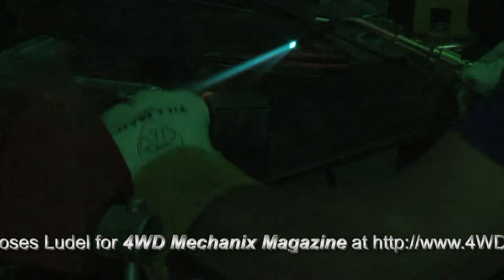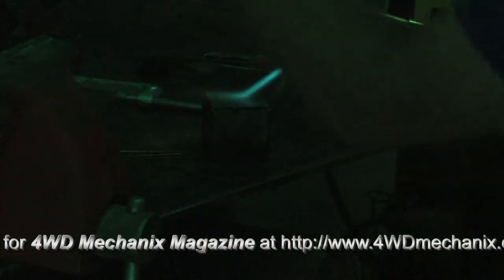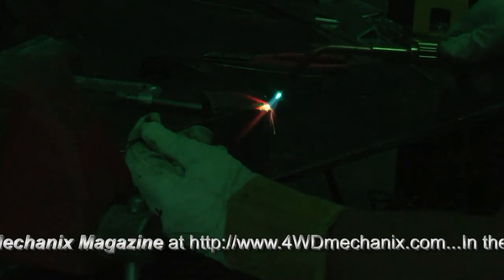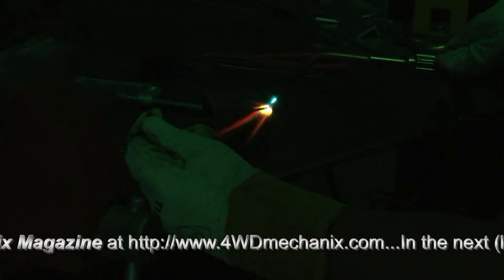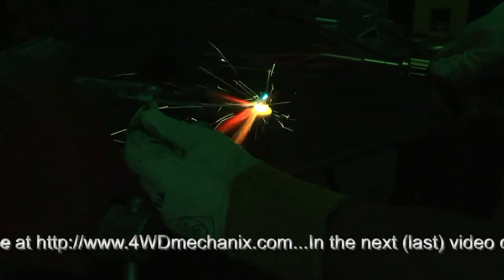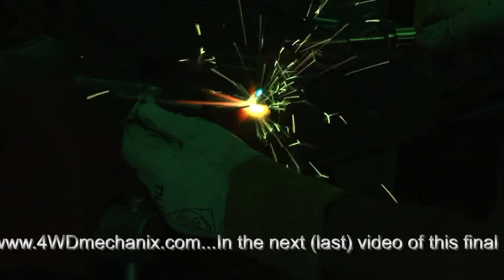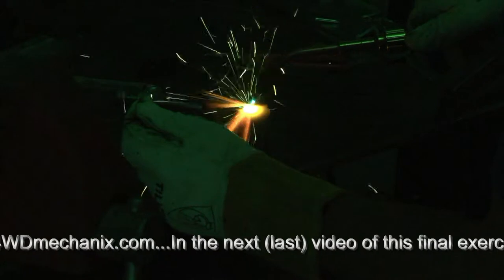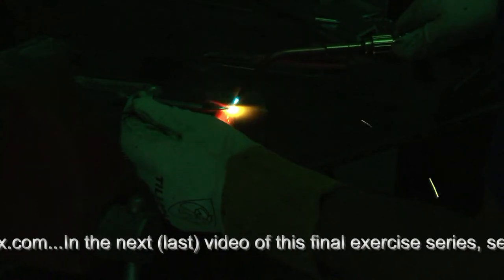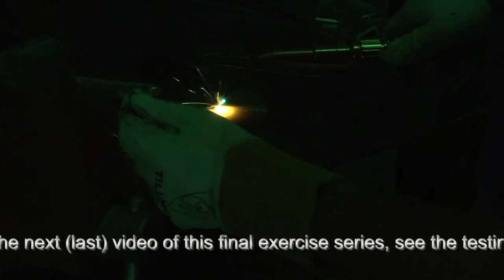This third corner has a wide gap on it, so I'm going to use the 3/32" filler. Watch how I bridge that to the edges and introduce the filler in such a way that we don't have an issue with burning back the sides or ending up with an extra gap. You have to introduce the filler at the right time. I've increased my filler diameter to 3/32" — the angle of the torch is also important for controlling the heat. Notice that I'm dipping the filler rod as the molten puddle forms. It's all about timing.